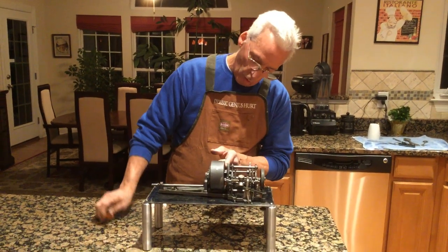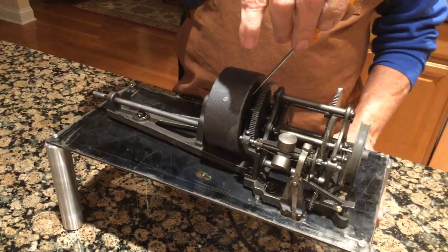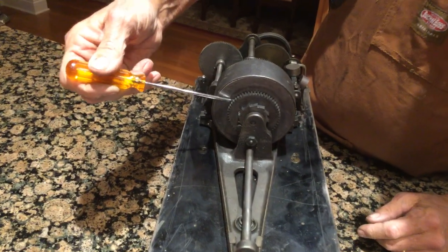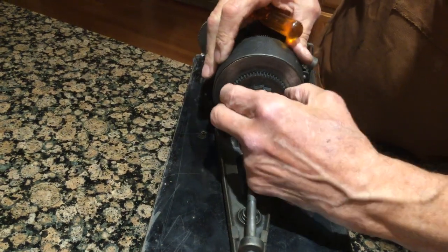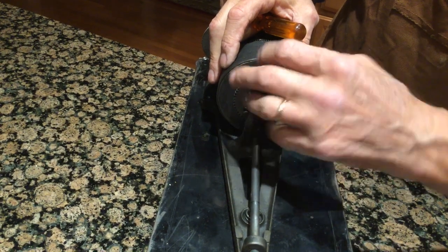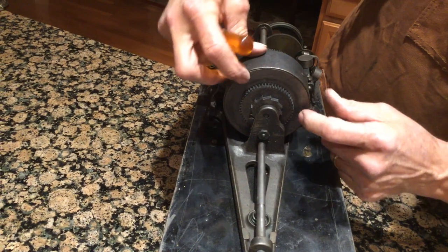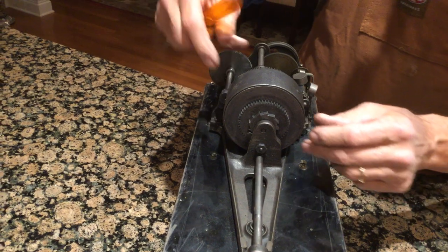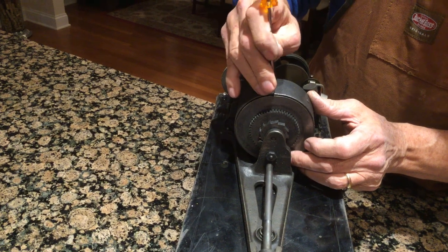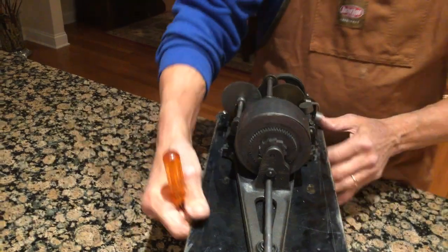Because these early ones have holes in the castings here — as you can see on video, you can see my screwdriver sticks in there — this plate has to come off. You'll kind of wiggle this and it'll pop out of the center of the spring. If it doesn't, you can pull the whole spring out. I have videos on how to pull the spring out with this in it. And then this one's loose — after you put it back together, you kind of want to lightly center punch the edge of this so it will press in place. This one's loose; I'd fix that on a restoration.